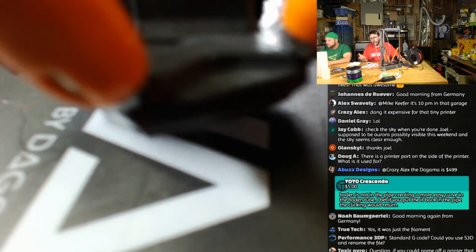If your extruder is clicking or clacking or making a noise, there's usually one of two issues. One, the nozzle's too close to the bed, or two, there's something impeding the filament path. With its auto leveling system, my guess was the nozzle wasn't too close, so it was a matter of checking the filament path. We were able to straighten the Bowden tube and attempt to push the filament through. It bound up. We tried a different filament, and it worked.